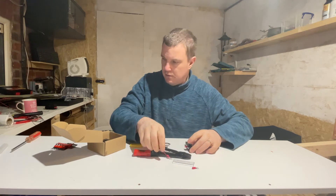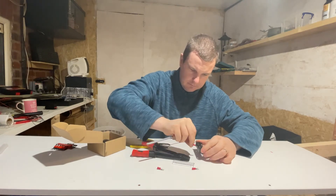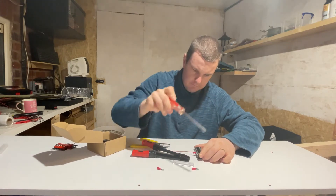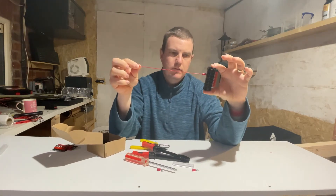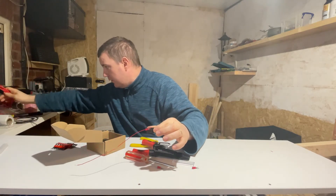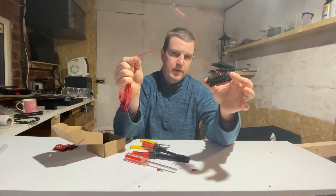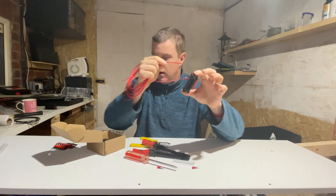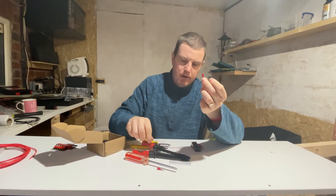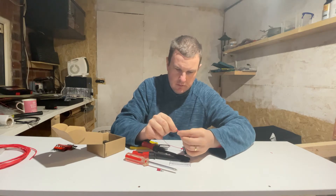And then, as before, slot that connector in and screw it down — there's your dropper wire attached to your bus wire. The bus wire comes in one end and maybe out the other. Because there's quite a bit of room in these connectors, I might double that up to get more connections — put two wires in there. I might even solder them together for a better connection.